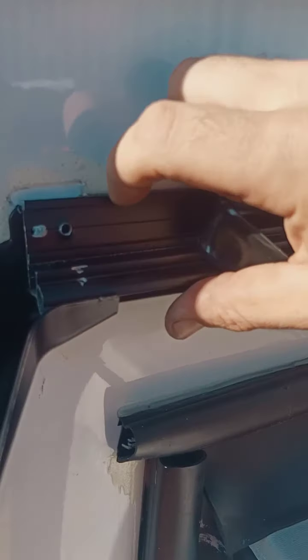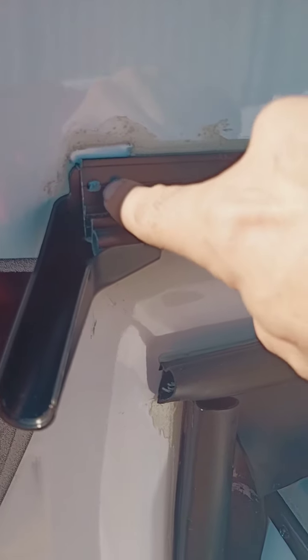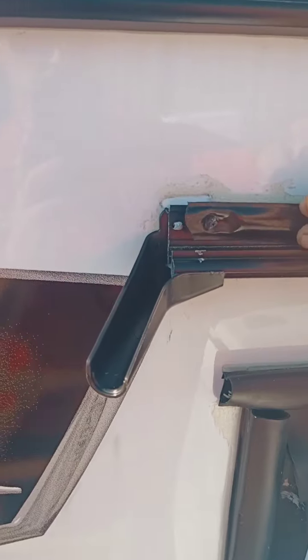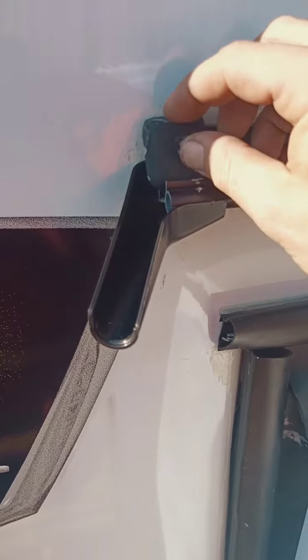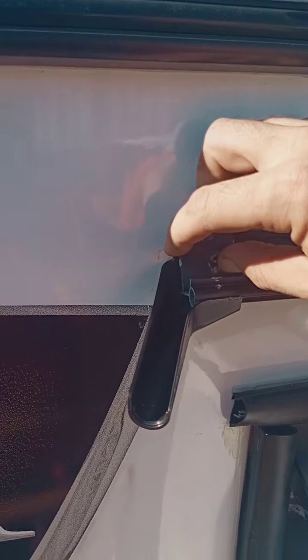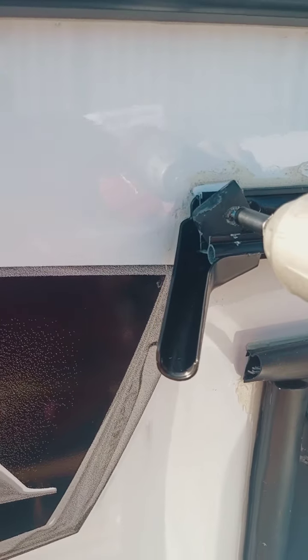After I pried it out, all I did was shove that gutter spout back behind this rail. As you can see, that plastic tab of the gutter spout comes all the way to about right here, so when we screw in at the old hole we're going to go right through that gutter spout and hold it in place. Let's go ahead and put our trim back in, push it back down into the track. Now that that's pushed back in, we'll put our cap piece back on, line it up with the hole, put our screw in, and resecure it.